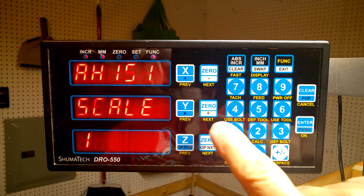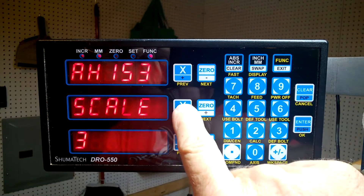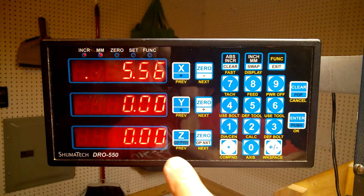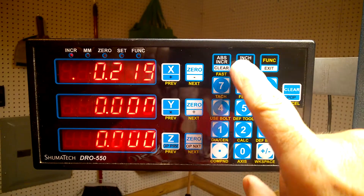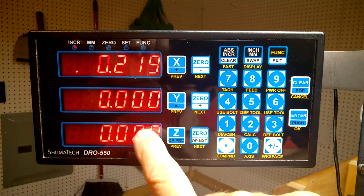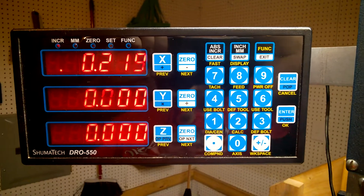Function zero — okay, Axis 3 Scale. You go through to Precision, 'Low' — that's what you want, so it's three digits in the readout. But I see what I did: when I made the mistake, I switched it between inch and millimeter.